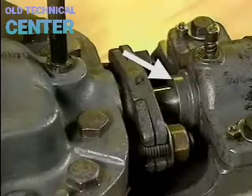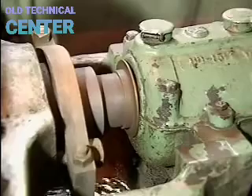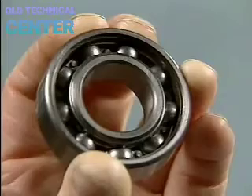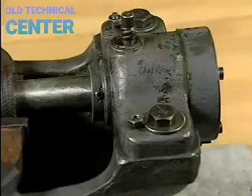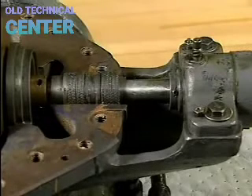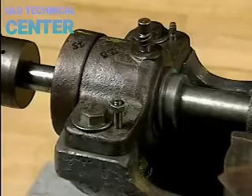The flinger — called a slinger in some plants — is a collar attached to the shaft between the stuffing box and the bearing housing. It prevents controlled leakage from getting into the bearings. The shaft bearings hold the shaft in proper position and allow it to rotate freely, supported by bearing housings at each end. On one end there is a thrust bearing and a radial bearing. The thrust bearing prevents the shaft from moving parallel to its axis; the radial bearing prevents perpendicular movement. Another radial bearing is at the other end.